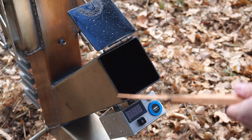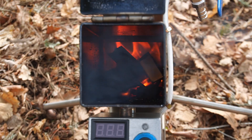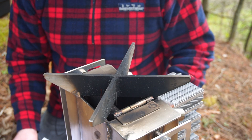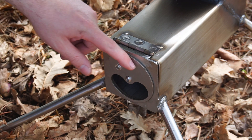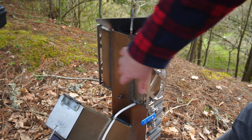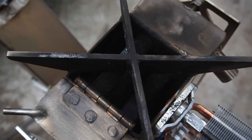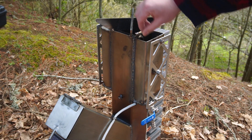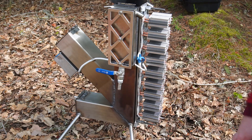So how well does this stove perform? Well, being based on the classic rocket stove design, it burns wood very efficiently and as you can see here, almost completely smoke-free. This is where the fresh air is drawn in and I've made a choke so that I can control the temperature of the fire. I've designed this rocket stove to have dual boilers — we've got a tank on each side and the tanks are connected with tubes that go right through the inside of the chimney. We've got a fill flap on the side. It can boil over two litres of water in about two or three minutes if you're burning good wood.